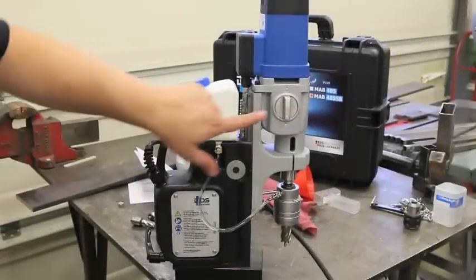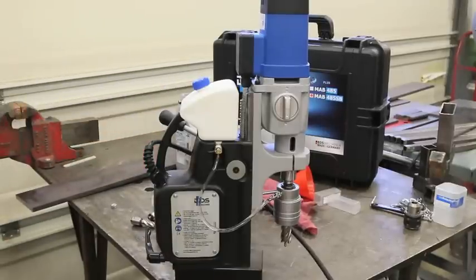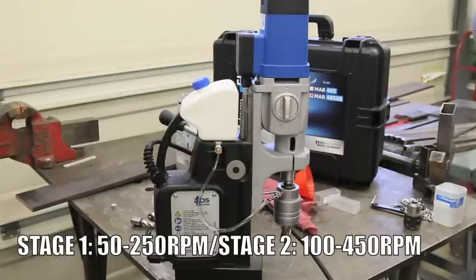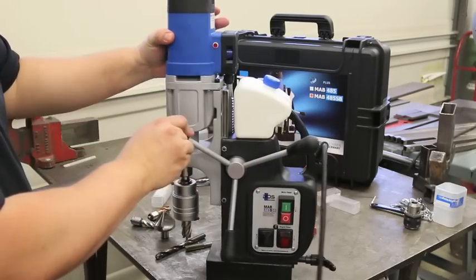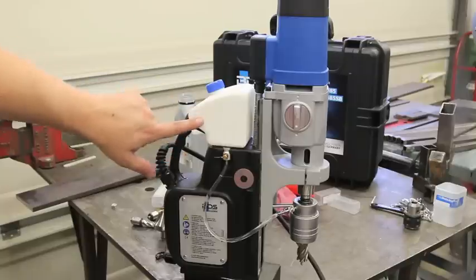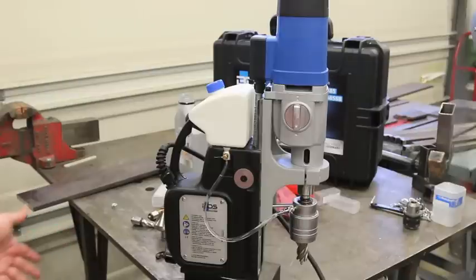Up here on the other side of the machine is a gear selector switch — there's a one and a two. One is low gear and two is high gear. Looking at the directions, the low speed is 250 RPM on stage one, and the top speed on stage two is 450 RPM. In addition to that, over here there's actually a speed adjustment fine tuning as well. The reservoir for the lubricating fluid is here, with a little valve that opens and closes. That lubricating fluid goes right into the keyless chuck and then comes right down the middle and out of the annular cutter. What a perfect system.